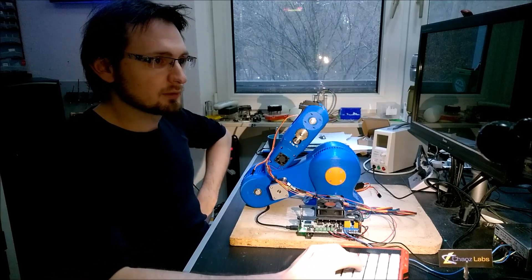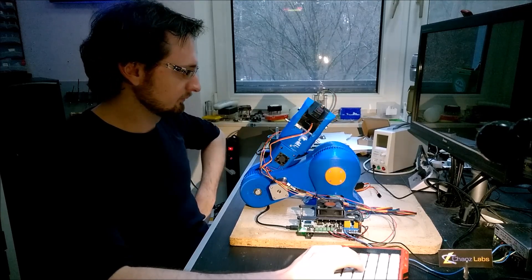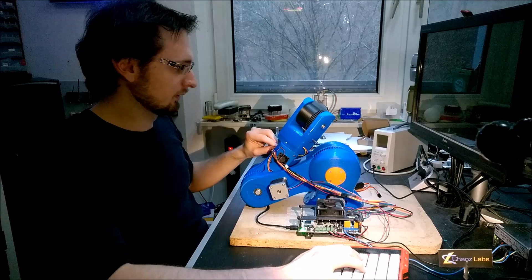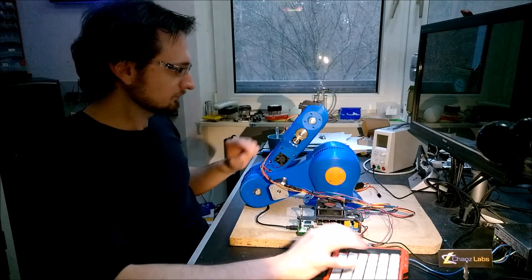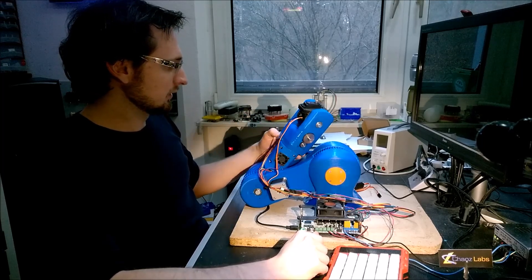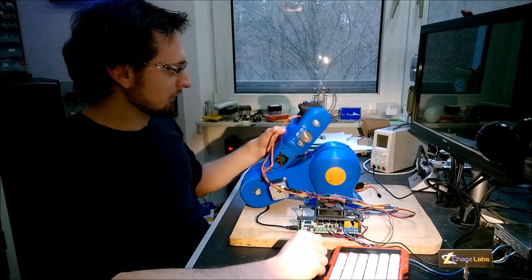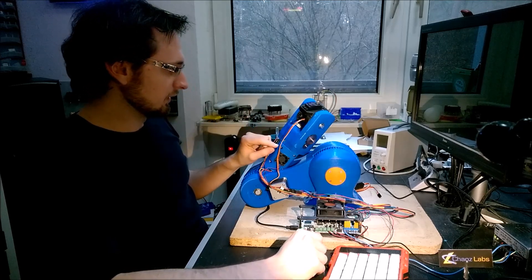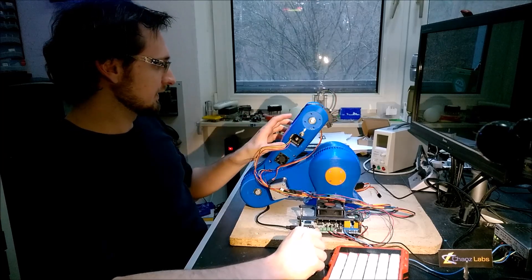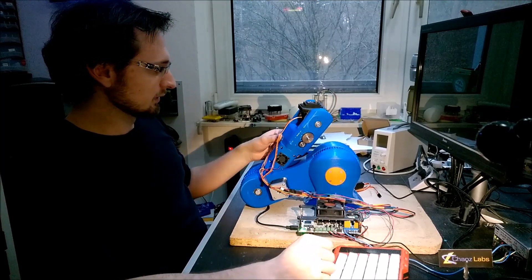So here are some movements. This joint has no end stop, so you can rotate it endlessly, which causes at some point a problem with the cables for the upper arm section. But since there's no end stop, I have left a little space so you can mount a magnet and a hall sensor to measure one single absolute position and trust the stepper motor to do the right rotation.